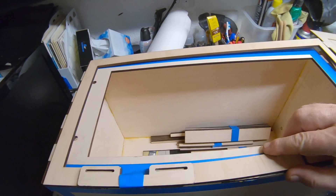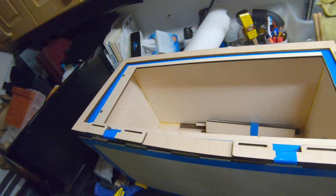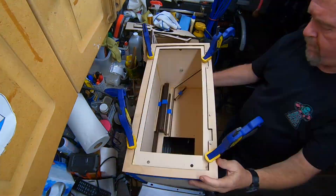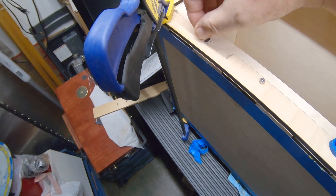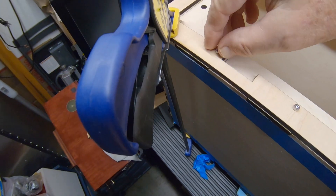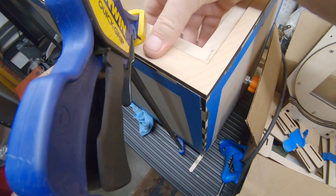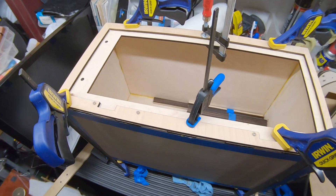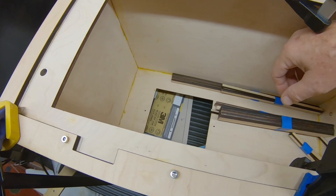The clamps are off. We have this flange for the door that we need to glue on, so I need to remove the tape first and then we can start working on the interior. I've got this flange glued down and I've lined up the screw holes for the slide brackets using metric machine screws, so both flanges are lined up together. Got some clamps going, and we're just going to let that dry. The next step will be installing these sticks down on the corners and edges inside to give it a light-tight seal.